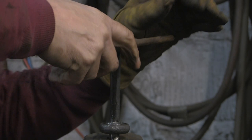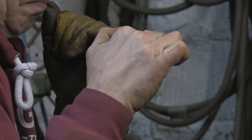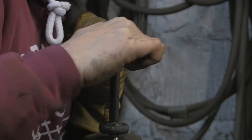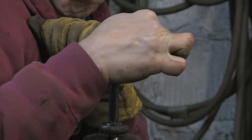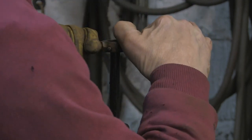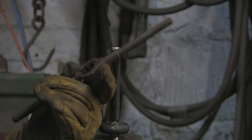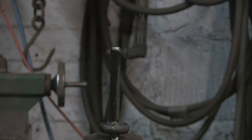Just look to see if it's level. It looks level, but I don't think it's got it. It's not biting. No. It ain't gonna have it. I think either the die has had it because it's been kicking around for years and it's probably blunt, or I could do with putting a bit more of a taper on that,